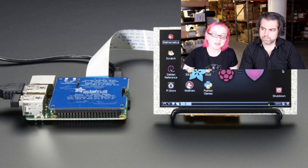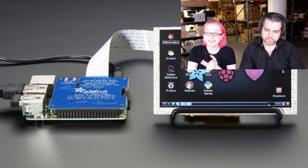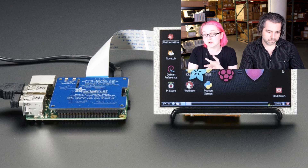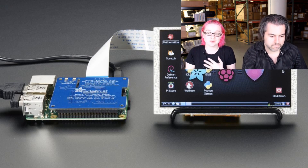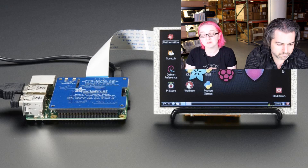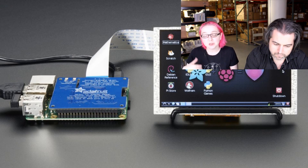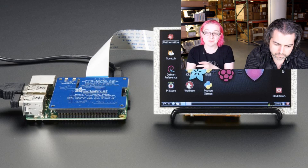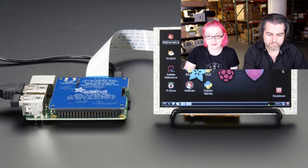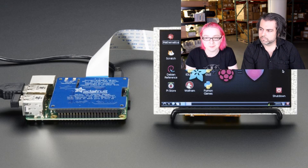This means less power — no HDMI cable going from the Pi to an HDMI decoder to the display — and it's a lot less expensive without all that extra circuitry. The trade-off is these displays use six red, six green, six blue pins, dot clock, hsync, vsync, and all that — it uses pretty much all the pins on the 40-pin connector, all but five, including the I2C pins, UART console pins, and the two pins you'd use for an EEPROM. Everything from pin 2 to pin 21 is taken; you can't move them — they're hard-coded in the chip.